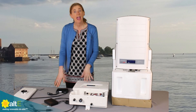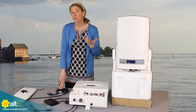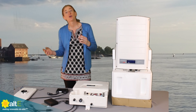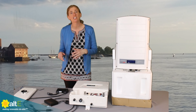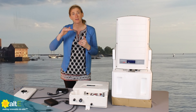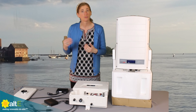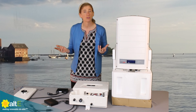You can do one or two strings, and these have longer string sizing. On the 3000-watt, you can have up to 4650 watts in; and on the 3800-watt, you can have up to 5900 watts installed. So this allows you to have a higher DC to AC ratio. In less than ideal situations, you're going to be outputting more. If you do hit that 3800-watt output, you will clip and the output will cap at that. But in areas with less than ideal weather, it's very common to greatly oversize the DC input so that you can have greater AC output at more times throughout the year.